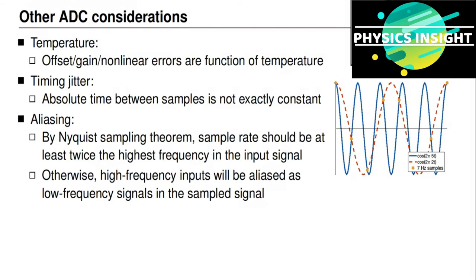One factor in our favor when designing a sample rate is that battery cells have long time constants and are quite slow devices, meaning we usually don't need to sample input voltages at a very high rate due to battery cell dynamics. However, it may be more important to sample quickly if the external load has fast time constants. In an automotive application, the battery pack is connected to an inverter driving the motor, and the inverter's power electronics often have switching frequencies in the tens of kilohertz, causing noise at those frequencies on the measured battery voltage. Sampling more quickly can help mitigate inverter noise effects.